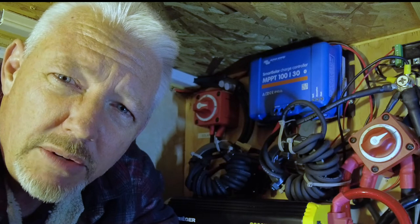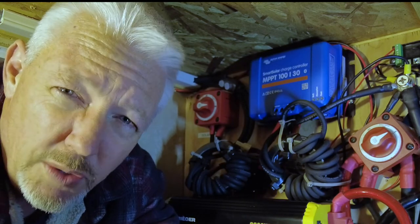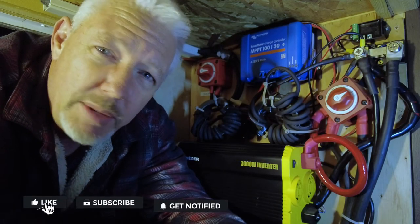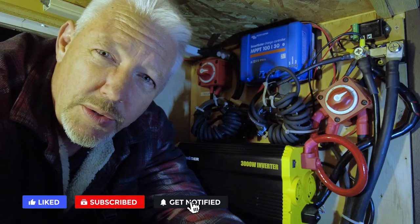This particular one is rated for 300 amps, which is a lot of power — a lot of energy going through. It's rated at 300 amps continuous and 500 amps intermittent, so if you had a super huge load, you'd only run it for a little bit at a time. It's rated for 48 volts DC. My RV and most RVs run at 12 volts, which is well within the range for operating safely.